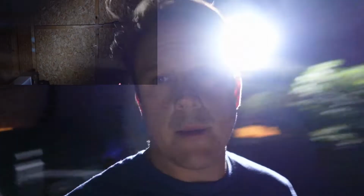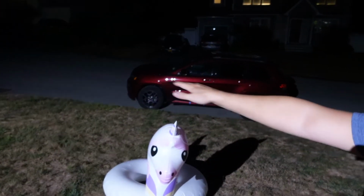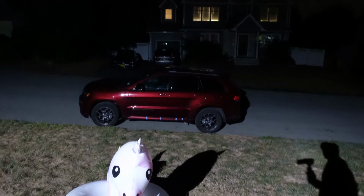This is one of those things that's really tough to mock up, but I want to sort of show you here as you come around this way. I'm going to turn this back behind me. I'm in that beam. I'm being lit directly, right? But as you sort of see that fall off in that linear spread, I'm going to get out of the shot here. You can see that linear spread is cutting all the way up across the street because of the rotation of that optic. That's what's possible with these light sources. So if you're talking about a wall wash effect, or you want to light a pathway, or do something really narrow and direct, you've got all of those optical capabilities.